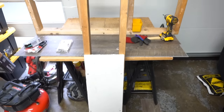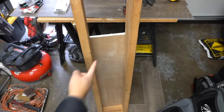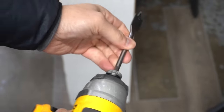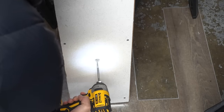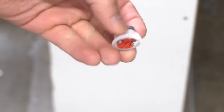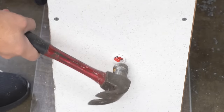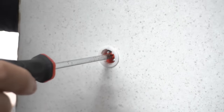Here's a test mock-up that I made — it's five feet by ten inches wide. That's where we're going to be hanging these drywall anchors. We'll drill the hole, then take the Gripit drywall anchor, place it inside the hole, and just tap it in.